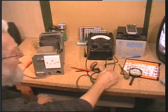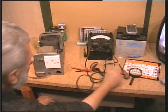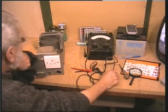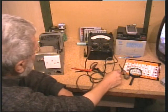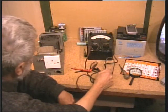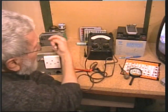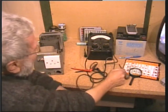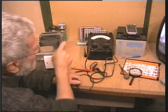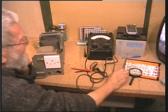Now we're talking about a brilliant bloke here, a good bloke, someone I highly admired, but he was just not seeing the obvious. So what was it? You're going to laugh. Somebody had either changed or checked the plug, and they'd put the wrong top on the plug, and it was deeper. And when he pushed the plug into the wall, it allowed one of the pins to go back into the body of the plug. But when he pulled the plug out from the wall, there was enough spring in the wire to push the pin forward. So, don't overlook the obvious.